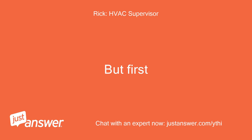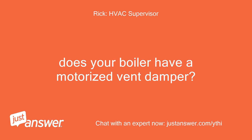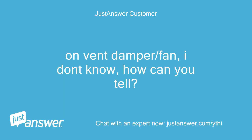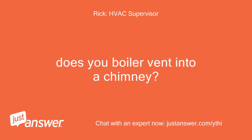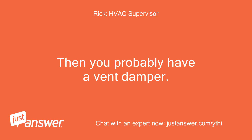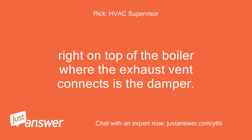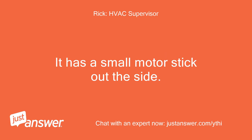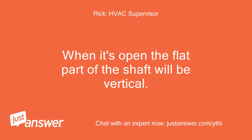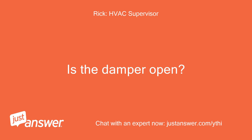But first, does your boiler have a motorized vent damper or a draft inducing fan? On vent damper or fan, I don't know — how can you tell? Does your boiler vent into a chimney? Yes. Then you probably have a vent damper. Right on top of the boiler where the exhaust vent connects is the damper — it has a small motor sticking out the side. When you turn the power off then on, you should hear the damper open. When it's open, the flat part of the shaft will be vertical. Is the damper open? Did you hear it open?